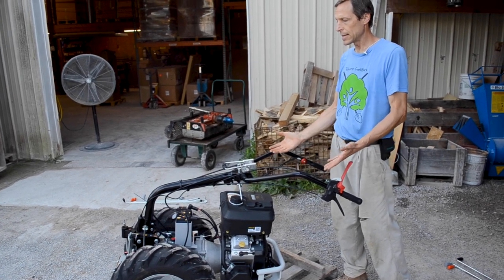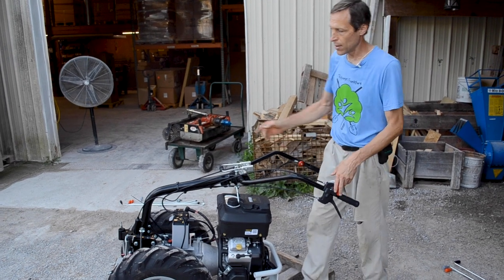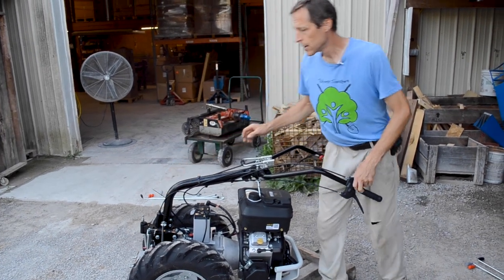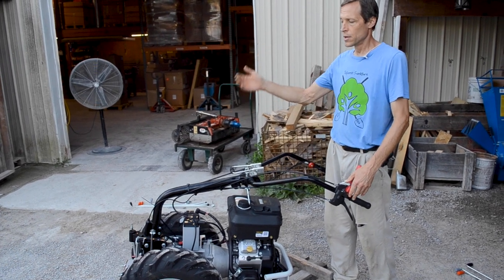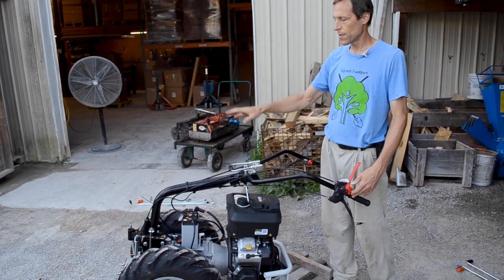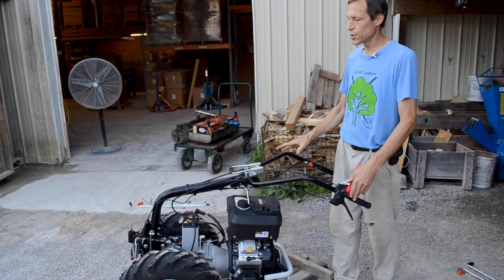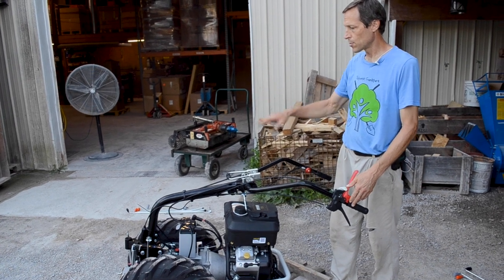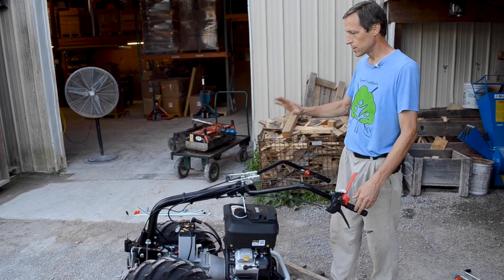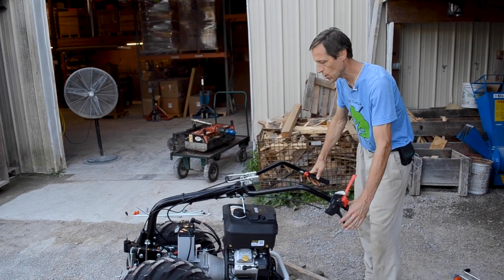the tractor obviously has the handlebars oriented in the front PTO position right now, this being the PTO of the tractor. This is the position you would run the handlebars in if you were running a mower, snowblower, chipper shredder, or some other front-mounted implement. The more popular use for the G131 tractor is soil working applications. So I'm going to turn the handlebars around and mount the gear shift levers with the handlebars in the soil working mode first, or the rear PTO mode.